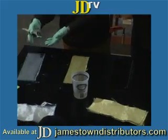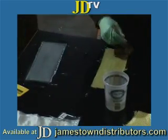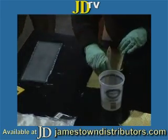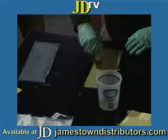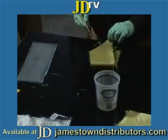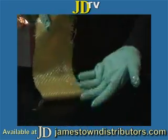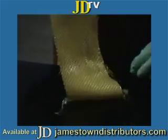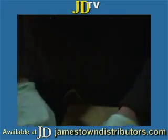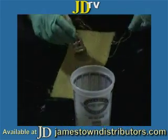There's a difference between wetting out glass and wetting out carbon and Kevlar — it's just a lot more difficult to feel comfortable that you're doing a good job. You can peel that back and you can see the combination of having the substrate, the table pre-wet, and ensuring that you've got a lot of resin there — that's how I feel comfortable knowing that you've got Kevlar properly wet out. Obviously there's more resin than you need, but I'd rather be on the safe side with Kevlar.